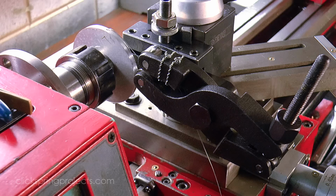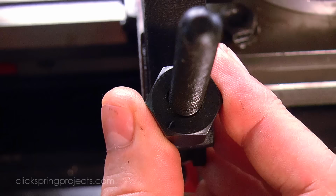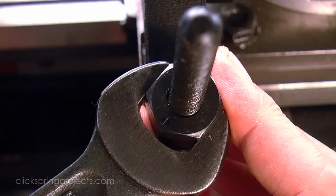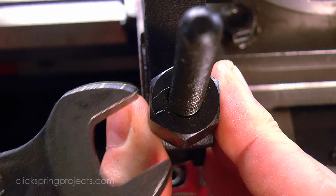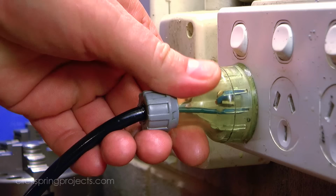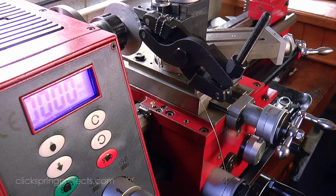An initial closing force is set using the knurling tool frame, with a small mark helping to keep track of that setting as the rolling progresses. Then, with the lathe running in reverse, the wire is pulled through its first pass through the rollers and loaded onto a spool.